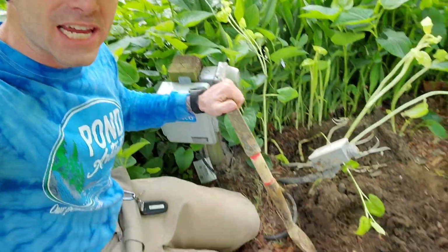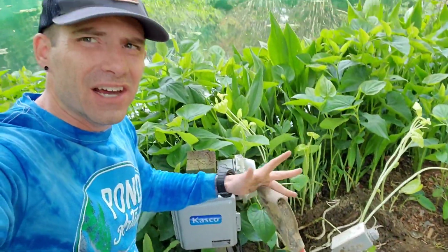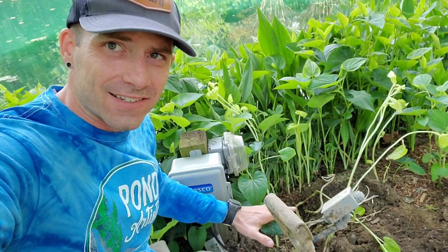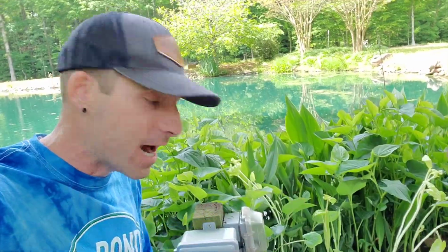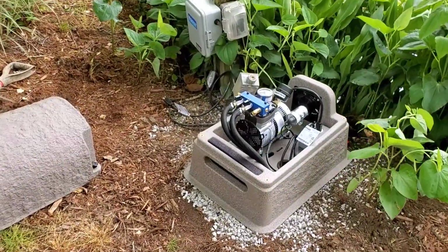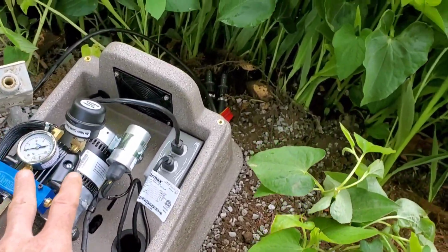The old base from where the original aerator was sitting was all uneven and unlevel. So I'm over here now with a shovel just trying to excavate this area down a little bit. Hector is bringing some gravel over now, and we're going to get this all leveled up before we set our new aerator down on top of this same area. Hector and I have just finished leveling up, getting all this tamped. Everything is nice and solid.